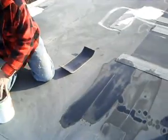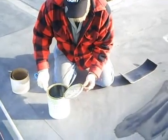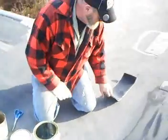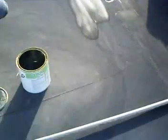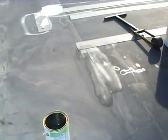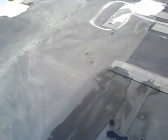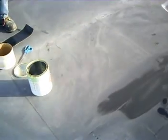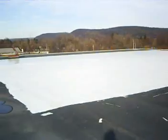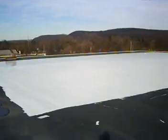They say you don't need the primer, but if you use this primer — which is basically like a contact cement, only quite a bit thinner — the tape is an adhesive-backed patching tape, six inch. If you use that primer and put this down, you'll have to rip the roof off to tear that patch back off. The way we look at it is, if you're going to put something on the roof that's going to last 15 to 20 years, you don't want whatever is underneath coming back up.